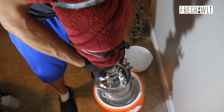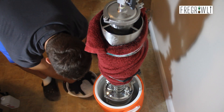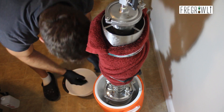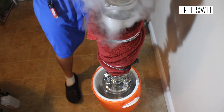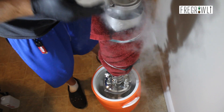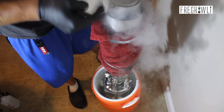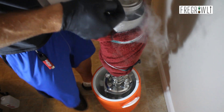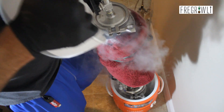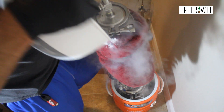Keep in mind the listed operating temperature of the Best Value Vax units is negative 40 degrees Fahrenheit, probably to ensure the tri-clamp seals stay in good condition. While you can certainly use the block-style dry ice available at many grocery stores, the nugget or pellet style will be much easier to work with. Once topped off with dry ice, fill the remaining area in the sleeve with denatured alcohol, which can be found at any building materials store, often in the paint aisle. It allows the slurry of dry ice and denatured alcohol to remain liquid at temperatures far below zero degrees.